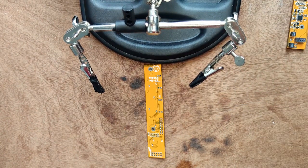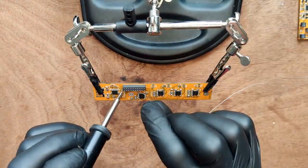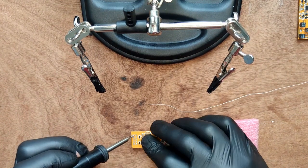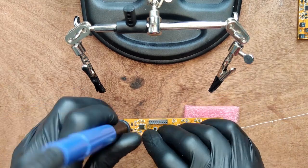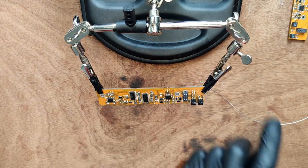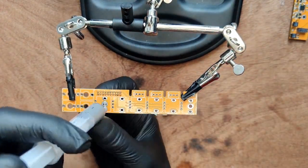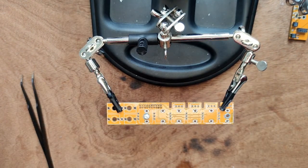Now place the small 10-pin male header on the bottom of board B. After that, place the 10-pin Eurorack power header on the bottom of the same board. Now solder the small 10-pin male header on the bottom of board C. To make your PCB sandwich, solder the screws in place under the potentiometers. We're using solder paste, but make sure none of it goes through the hole as it might block the screw.